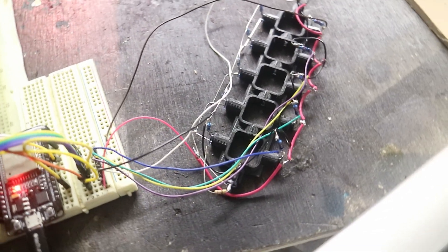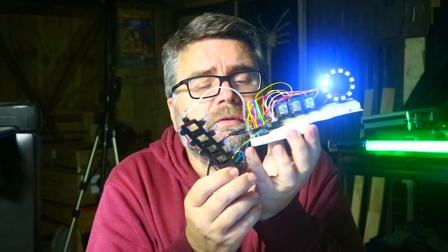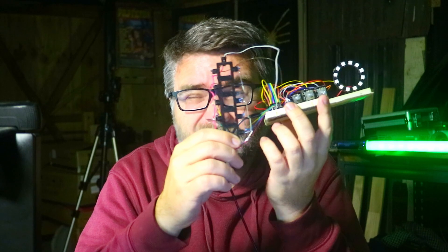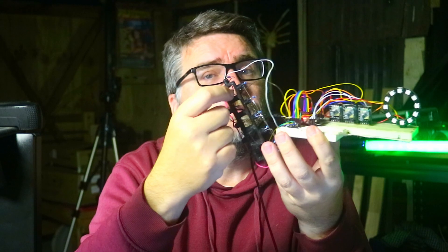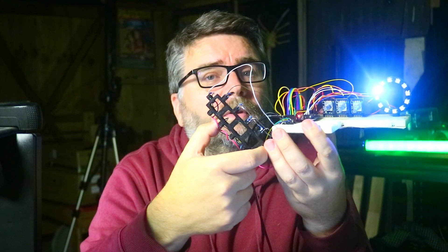So I made this jig circuit — it looks a bit Frankenstein-ish. I've got one row at the moment. In the design I've got the NeoPixel ring, which I'm just testing for the button colouring — check out the short I made about that. It's going to be programmable so you can set any colours. The button housing is hollow, and as soon as I put my finger in like I'm pushing a button, one of the lights turns on which corresponds with the button press.